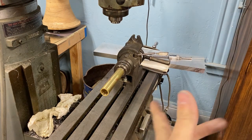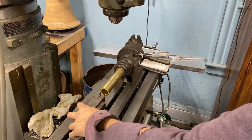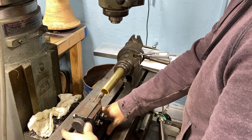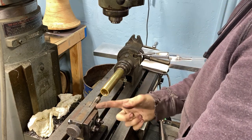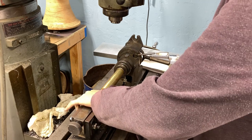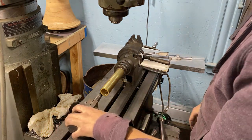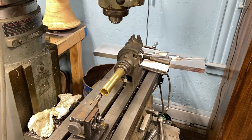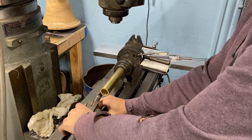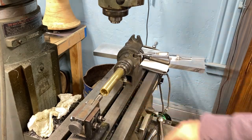So we need to machine a plug — I'll do that off camera because that's boring. It's just going to be a piece of brass that goes in there and has a center. Let me grab the tailstock. It's going to be the right height. This is a cheap little tailstock I got with a cheap indexer a few years ago. Run it all the way out and then back in a couple turns. We'll make our plug nice and long so it gets easier to get this thing in and out. Just like that. We're going to wait until we get our plug in there to get this set up proper. We'll probably come back once I have it set up.